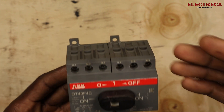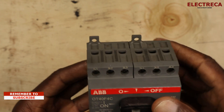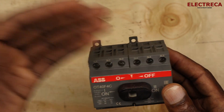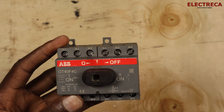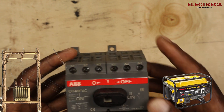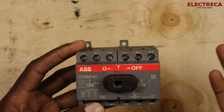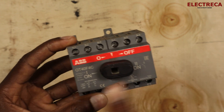It can use either three-phase or single-phase. For three-phase, the block has three contacts — you'll have your red phase, yellow phase, blue phase, or you may have a neutral and a live. You can use it on a small installation, maybe changing over between your utility supply and your solar inverter. It will work perfectly. It is interlocked — it can never allow both power sources to go through at the same time.